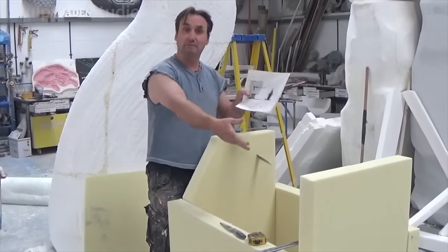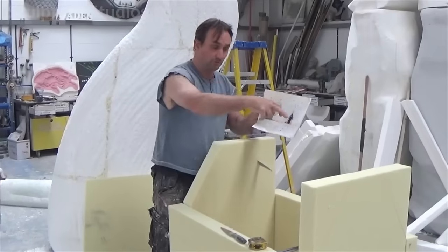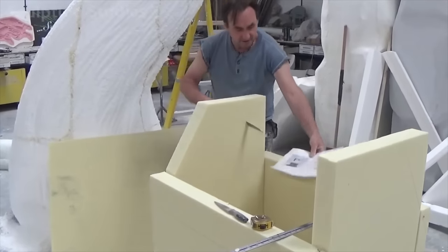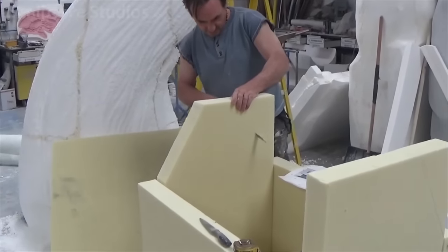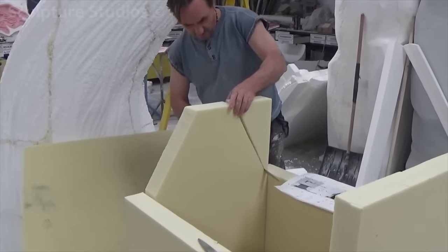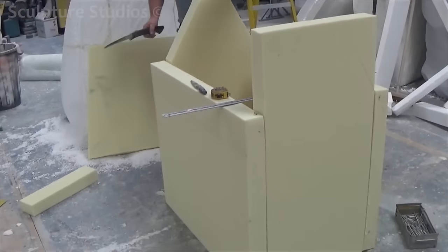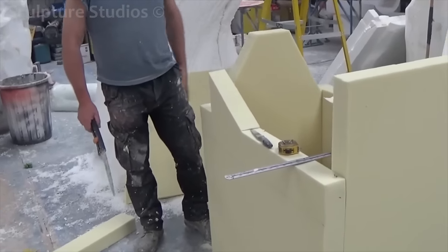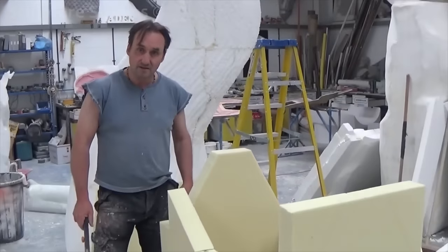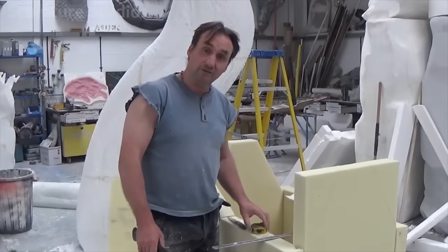For Snoopy, we've got to make a mould and make him as one unit, and then we're going to send away the casts to be painted. They'll come back and we'll probably bolt Snoopy on top, keeping the whole job nice and crisp. We've worked out the pitch of the roof at a 60 degree angle, and the whole thing's being kept hollow so they can just be moulded and laminated from the inside. The 75mm board ensures that the planks on the roof stay 75mm thick, so they look like thick wooden boards. We'll keep you posted along the way.